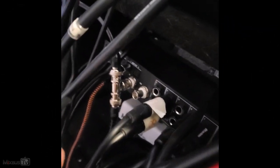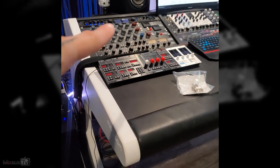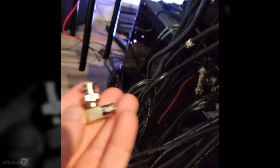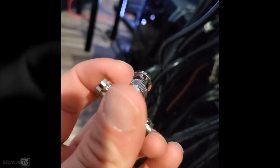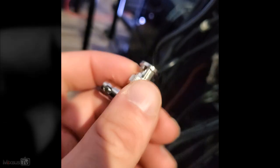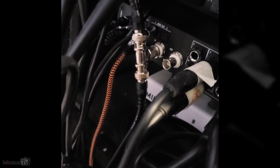You need to go from the master to the first slave, and then to the second slave, which in my case is the unit at the top. To make that connection, you need T-shaped BNC connectors. One cable comes in here and one cable goes out of here, and this part connects to the interface — to the first slave. The bottom cable comes from the master.